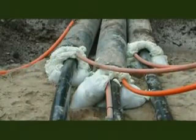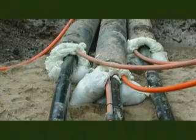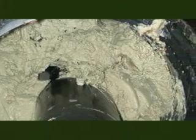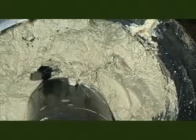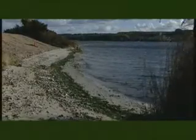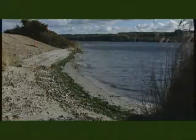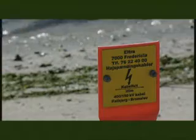Bentonite is as thin as water but assumes a jelly-like consistency after a few days. The bentonite ensures good thermal conductivity around the cables, which are placed in pipes. Following re-establishment, marker stands are erected at selected spots. The stands are typically erected at field boundaries and where roads are crossed and where it's likely that excavations may take place at a later date.